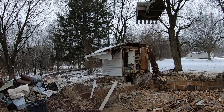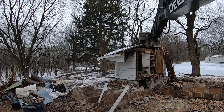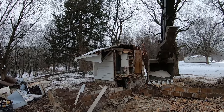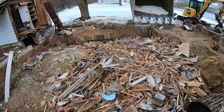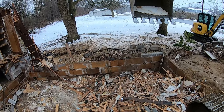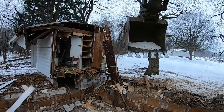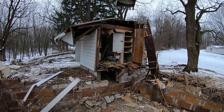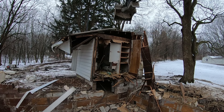That's all done. Now we're on to pulling the bathroom in. I can't reach it from outside the building — all I can do is reach that awning, and if I hit that it's just going to fall off there. What I'd really like is for this whole structure to come into the basement in one piece, so that'll help keep the mess localized to the basement where it's easy to clean out. To get over there, I'm going to drive out on my trash pile — that'll get us closer and kind of break stuff up. It's pretty standard to drive out on a debris pile for a house demolition because you can't reach it all.